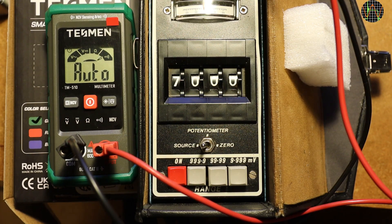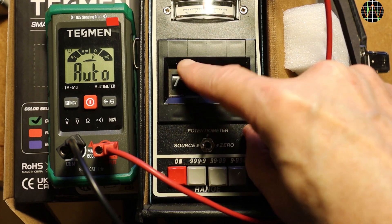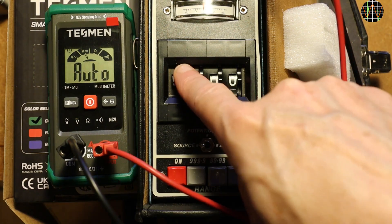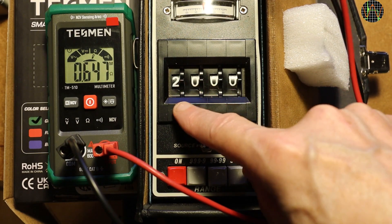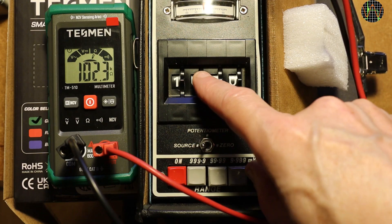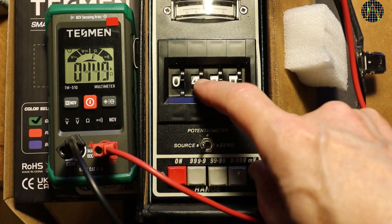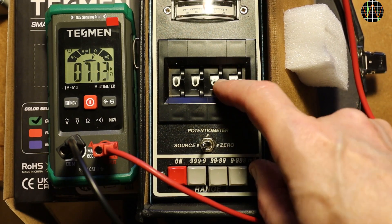Another effect of the smart input is that low DC or AC voltages can't be measured. At 0.7V the meter does not detect it. At 0.79V DC, still no joy. At 0.8V, after a bit of thinking, the meter finally shows the DC voltage and follows a 10mV increase as it should. Once below 0.8V the meter just shows AUTO, but 0.2V is interpreted as a resistance — the lower the input voltage, the lower the resistance. What is going on here is difficult to interpret because normally to measure ohms the meter creates a current on its leads. In this case there are two voltage sources — the one inside the meter and the external one — fighting against each other. A meter injecting its own current while you are trying to measure low voltages in sensitive electronics is something you'd rather avoid.